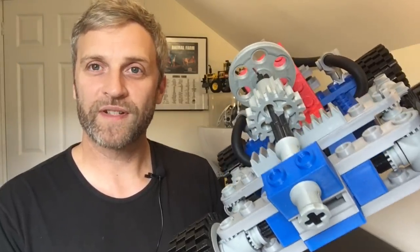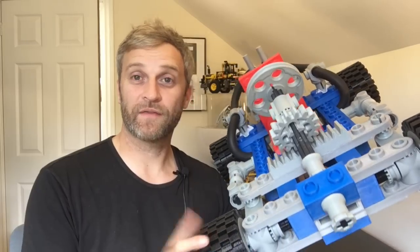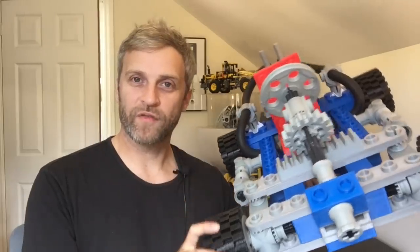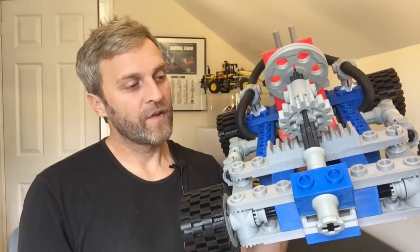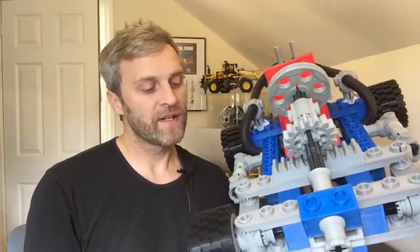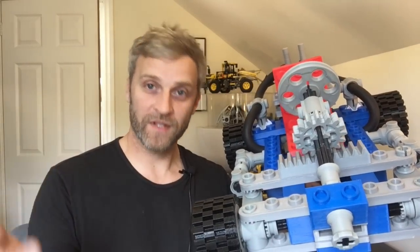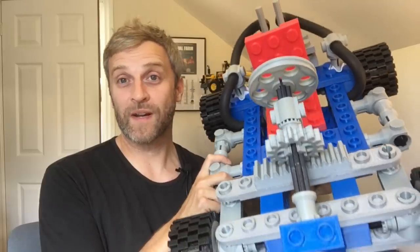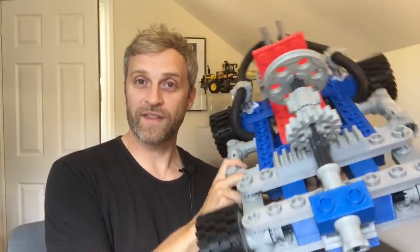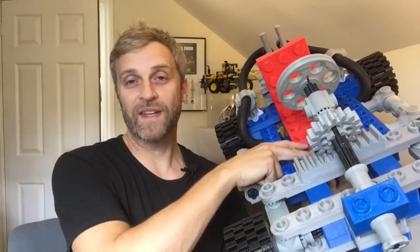Let's talk about how long it took and how much it cost. The build took about 168 hours — seven days — but that's not factoring in all the mistakes and failed parts and getting tolerances right, so you could probably add another three days onto that. The original kit weighs 80 grams. Scaling up five times means multiplying by the cube of five — 5×5×5 = 125 times the mass — so theoretically 125 × 80g = 10 kilograms. Well, this actually weighs in at 5.1 kilos, obviously because the parts are only about 20% infill rather than solid.